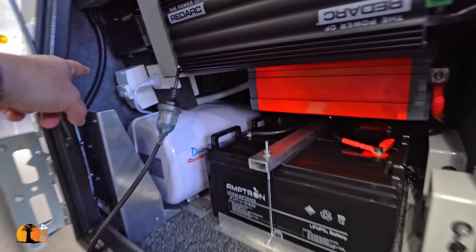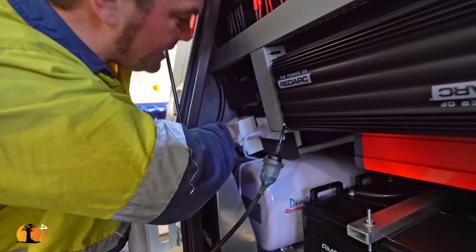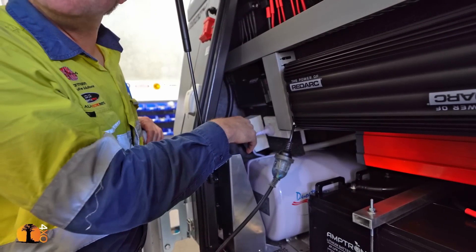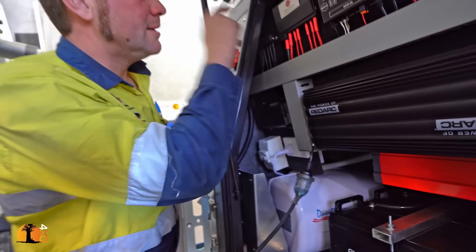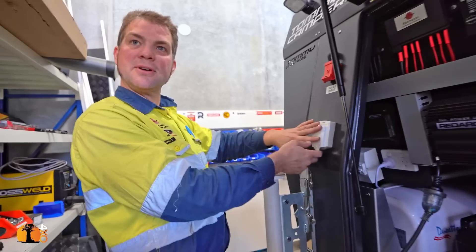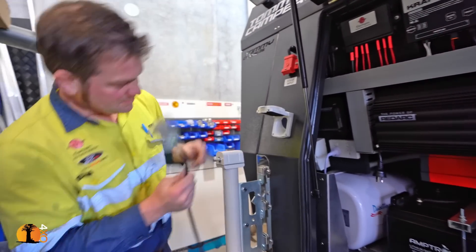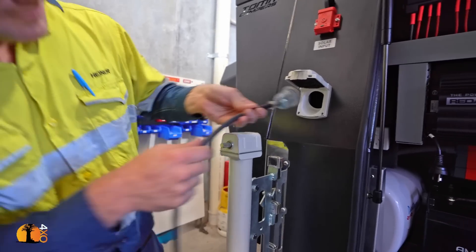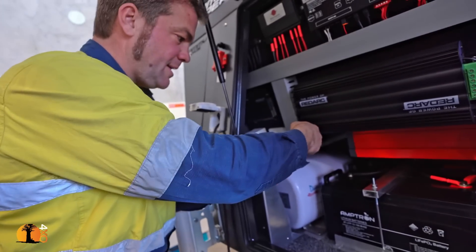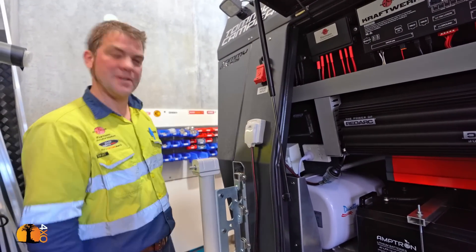If you have a shower there, this will be open anyway. So you put the AC there. That is your RCD and main circuit breaker, and from there we've got three twin power outlets — one here, one on the inside, and one on the kitchen side. This here is not your normal socket. The idea is you can see there's just a hole in it — you feed your cable through there, plug in your charger, and just close it again.